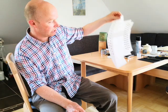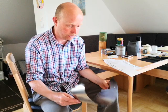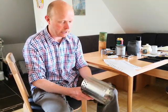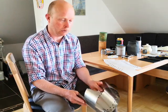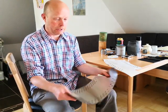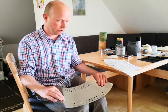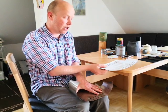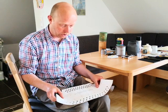So once you've got that printed, it needs to actually go on your titanium foil. Now, as you'll notice, it comes in a roll. And once it's rolled up, there's absolutely no way you're going to roll it in the other direction, ever. You just ruin it. So you've got to work with that roll. So you find a place, unroll it, and you'll notice that I'm looking at the inside here, not the outside. Depending on your punch, but I think generally it's a good idea to put your pattern on the inside, the bit that's going to curl up like this, okay?